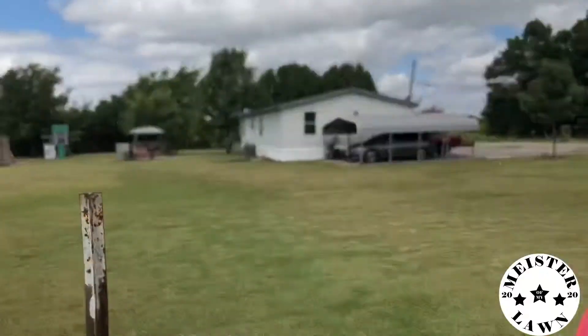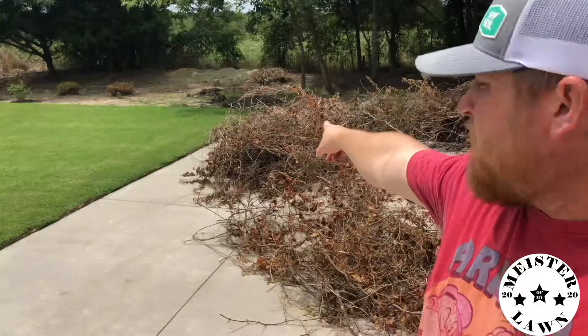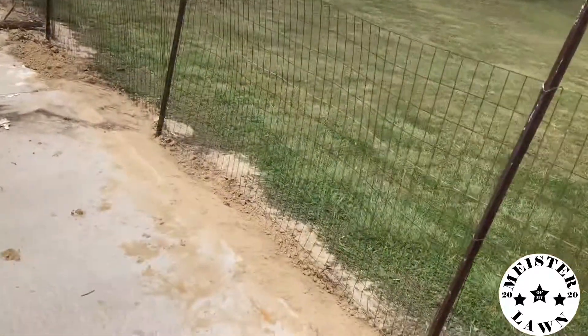So what I'm doing is using the same sand that we have here, bringing it back up, compacting it down, and having it drop off at an angle. Because when we put this concrete driveway in, everything flows back into this corner — that's why I put that drain back there. The main point is that it doesn't drop down past the concrete anymore. I feel that sloping it like that and compacting it really well will help. With me compacting it at 230 pounds, it's going to be fine. I'm going to get back to work.